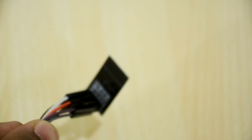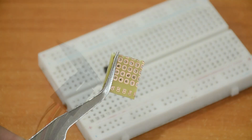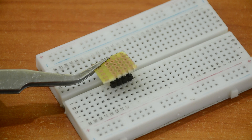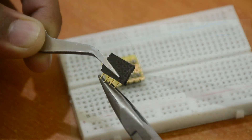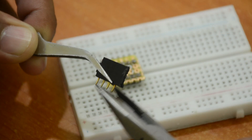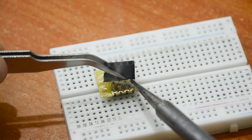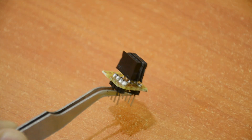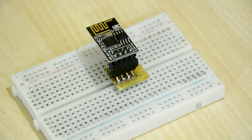As you can see right away, the board itself is not breadboard friendly. You can either run jumper wires to your programmer or just make a simple hack. Cut a piece of 4x4 PCB, place it on two rows of header pins like this and solder them. Then add two rows of female header pins on the top centre. It might be easier to bend the pins and solder them on top. Your ESP01 is now breadboard friendly and ready to be programmed.